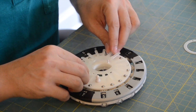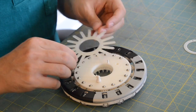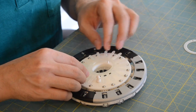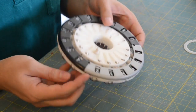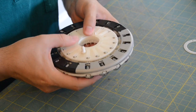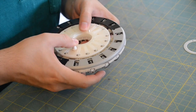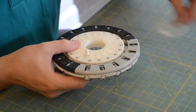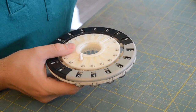Place the spider spring onto the carriage casting so that every finger of the spring rests over a ball bearing. Place the spacer over the spider spring, then press the clearing cover over the rest of the carriage.